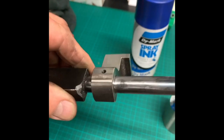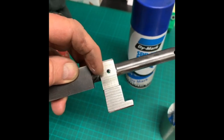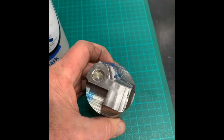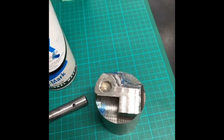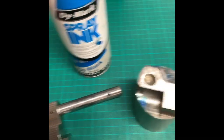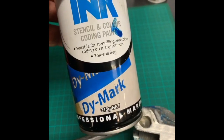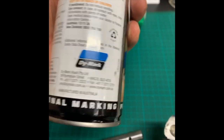We've got the finale — we've got the part made. It's not the most beautiful part in the world, but it fits. All I have to do now is do the taper pin and lock it in. This is what's left of the blank that we worked off. The exercise of machining it from round rather than flat, and using the dividing head to get all these facets done in one setup, worked out very well. By the way, this is my go-to marking blue — it just sprays on, very easy, very clean. This one's made in Australia. Thank you very much.